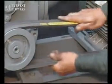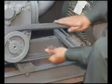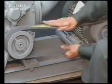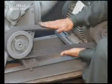At the time of commissioning of the blower, check the blower for free running by rotating the blower pulley by hand. The blower should be free to rotate in either direction. In case tightness is observed, rotate the blower pulley by hand clockwise and anti-clockwise. If unable to do so, try a little harder.